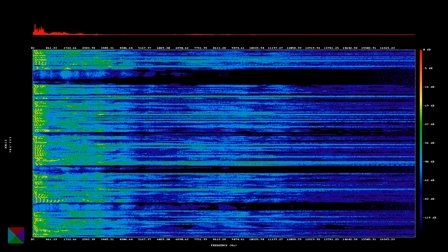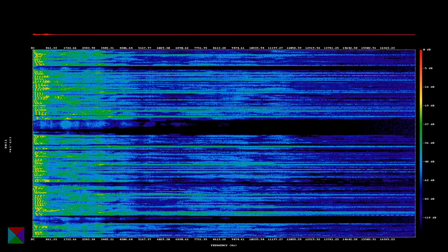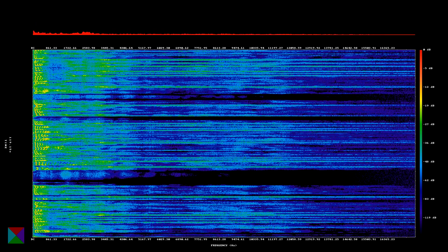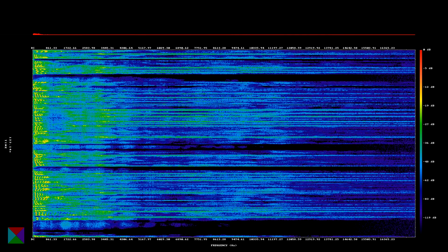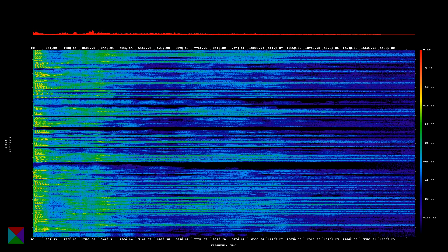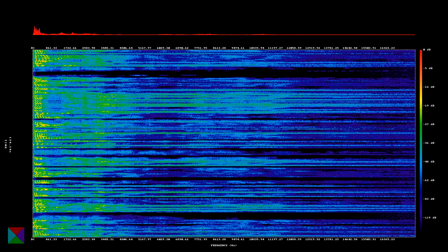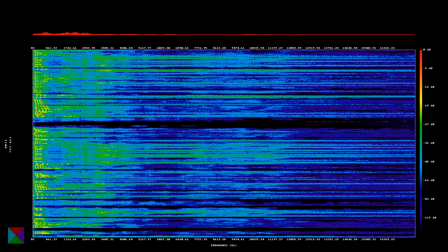As any self-respecting amateur, I was dragged down the path of last resort to read my user manual, where I discovered that in addition to CTCSS — a way to transmit a tone to open a repeater — there's also a setting called Tone Squelch, or on my radio, TSQ, which will keep my radio's squelch closed unless it hears the CTCSS tone from another radio.